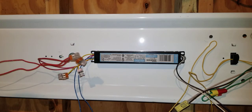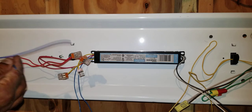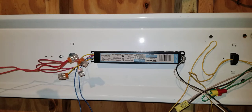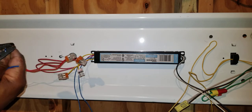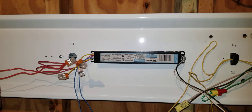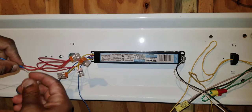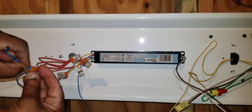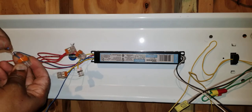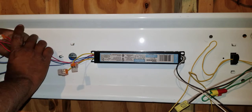Now I've got two blue wires — two blue wires and two red wires on one end. Strip the blue wires and simply plug them into the Wagos. This is a lot faster than wire nuts. Then just roll them up in.